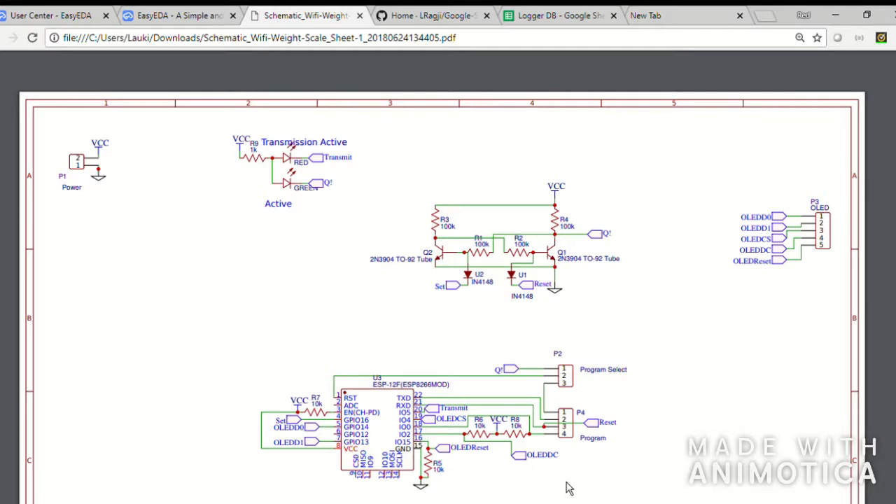The circuitry around the ESP8266 is very simple — it is just the basic circuitry required so that I can program the ESP8266 on the circuit board itself, as well as connect an OLED display. There is a section on the board for an OLED display and I have made provisions for it, but I haven't connected any display because that also consumes power. The OLED did help me debug through the project and verify the correct weights, but it is optional.